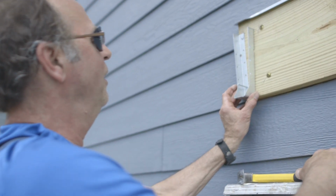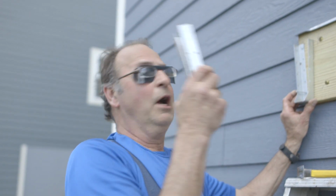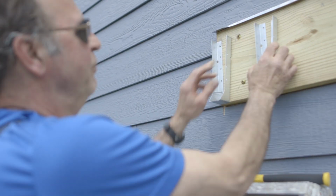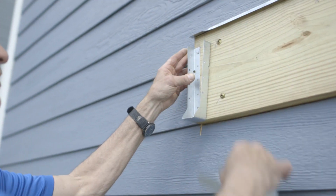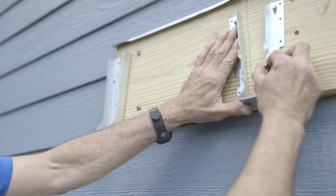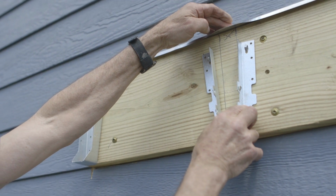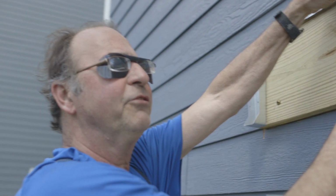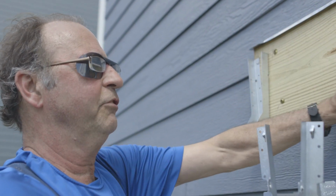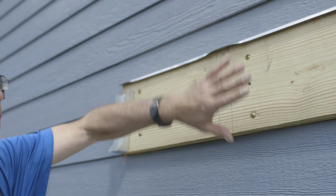All right, this first joist on the corner that will be running out past our post is a reverse flange joist, and that's just because it's on the end here. Now, when we get to these other ones, we'll have the normal flange, and what we'll do is we'll set each joist to the top of this, and we'll use a little setting block because these joists do vary just a little bit in height, and we want the top to be flat. We don't care about the bottom.